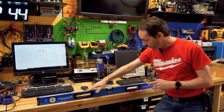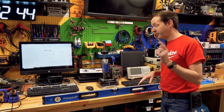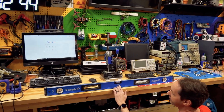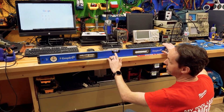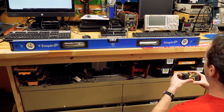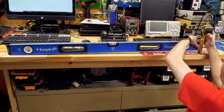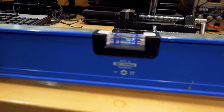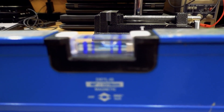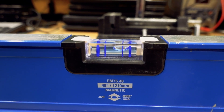So on a four-foot level, you want the drain to go down one inch. Watch this — right now this is sitting on my workbench and it's dead nuts level. But if I lift this up one inch, look at the line. See how it sits on the blue line, the outer one? That's your drain slope.